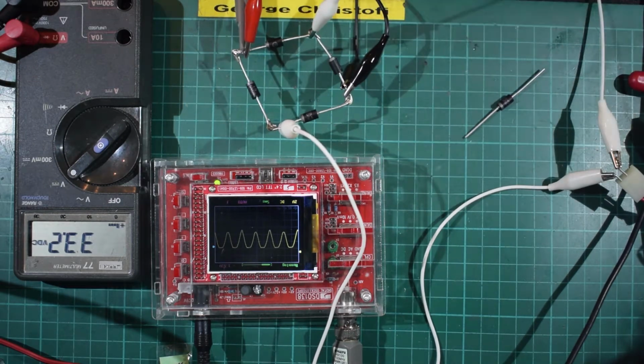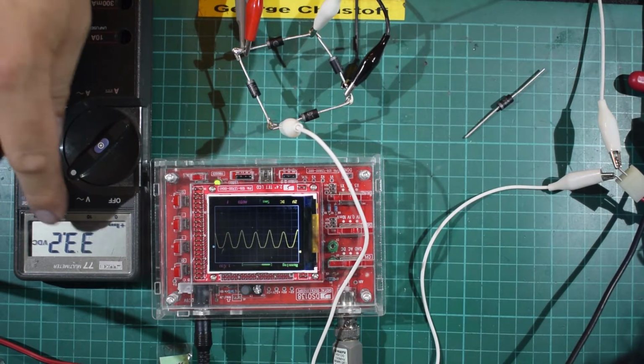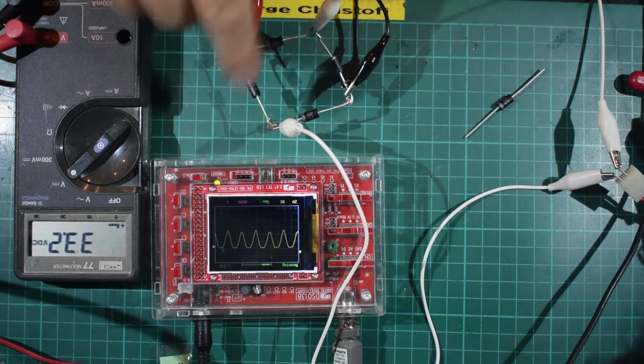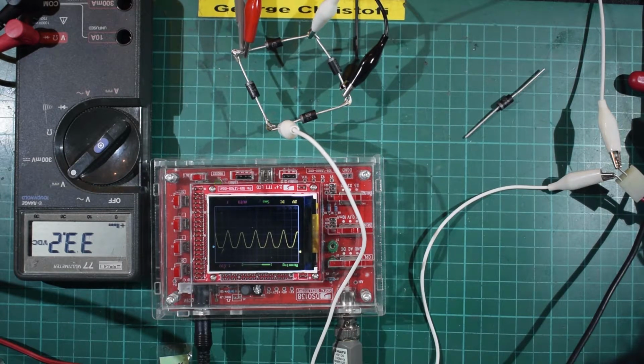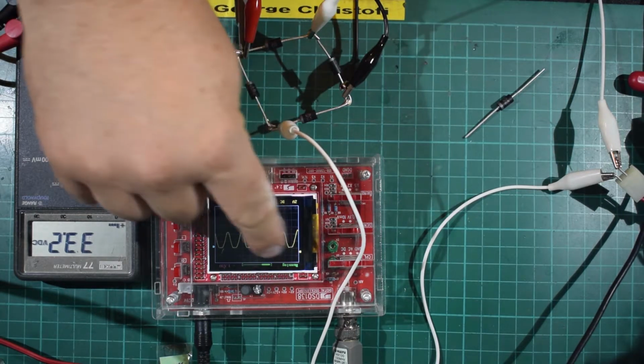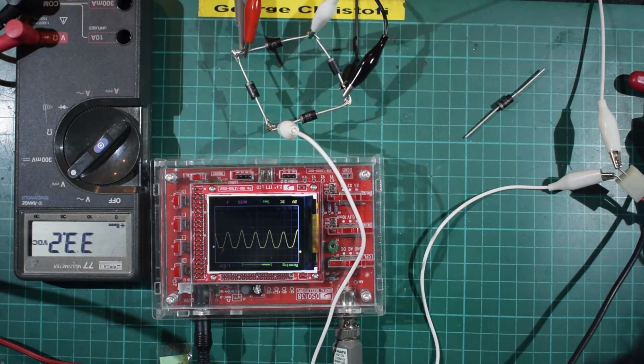Now, what we have here is we've returned to very close to the original voltage, and there's a reason why it's dropped, because each of these diodes has a voltage loss. But we've also now got 6 peaks on the screen, because all the negative side has been turned positive. So we've actually made it slightly more efficient in that respect. So we're getting more positive voltage and no negative voltage, which shows that you're getting a more efficient sort of rectification for your power supplies.